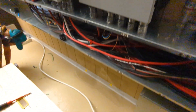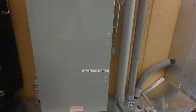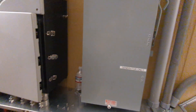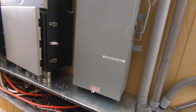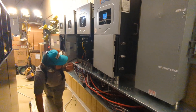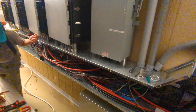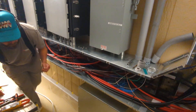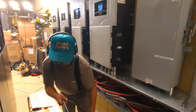The generator is going to allow us to throw the system into bypass. We never put up one of these systems without a bypass, because if you don't, you'll come back and make the customer very upset — their house could be down for hours while you're wiring in a new inverter or battery. Minimize the downtime by using bypass.